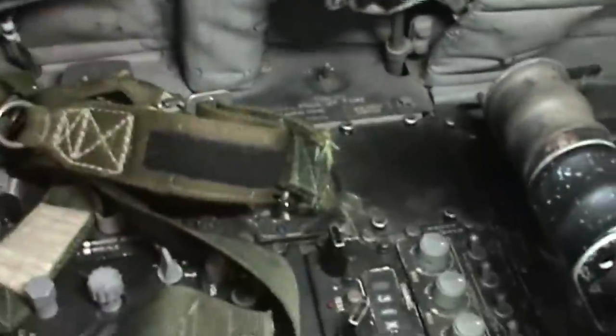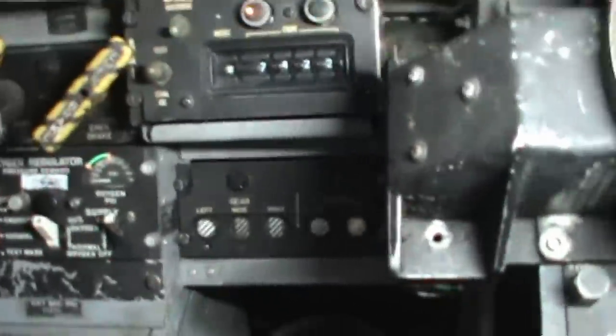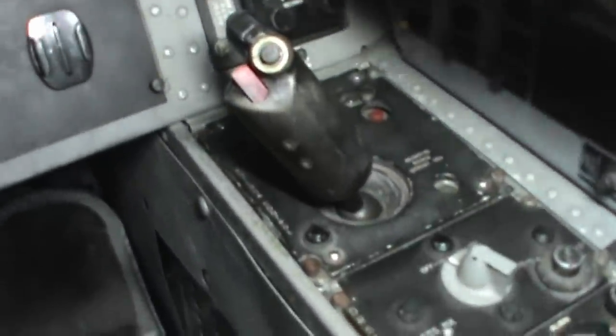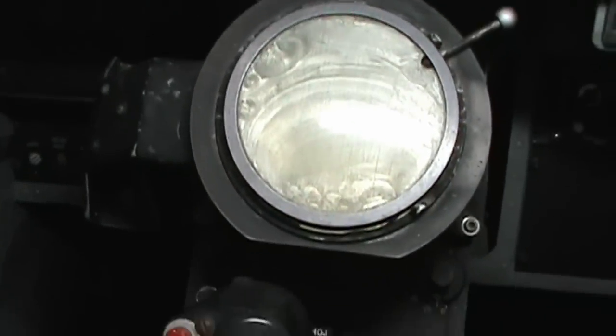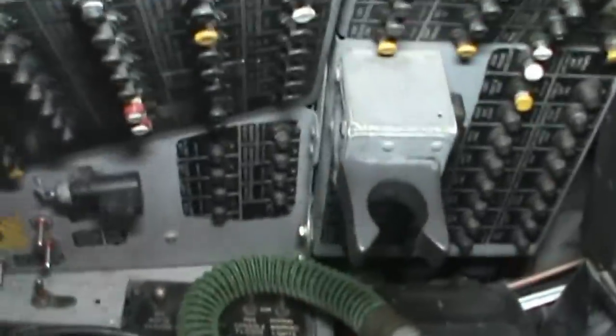Let's check out the WSO's cockpit — I'll do my best as we have the seat out. This was an Air Force bird so it was dual-controlled, meaning the WSO actually has a set of throttles and a stick. A lot of the stuff back here is duplicates of the front seat; some of it is WSO-specific — more breaker panels, emergency flaps, dual controls. There's one of your IFF control boxes, the upper instrument panel, and the hand control unit for the radar. Unlike the F-14 Tomcat where it was center-mounted between the RIO's knees, you had your radar display here and your hand control unit here.